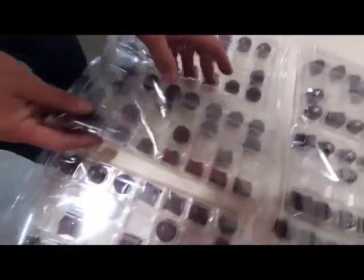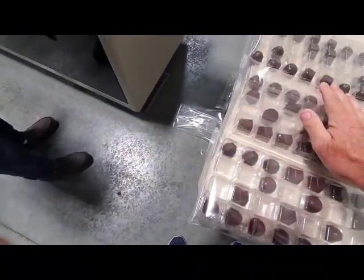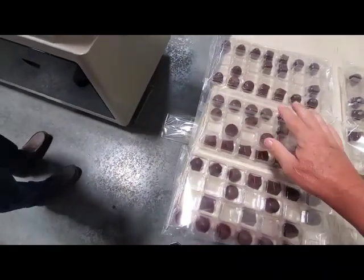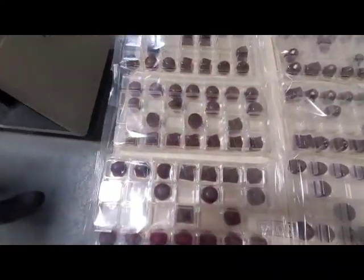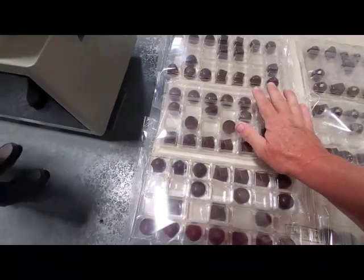These are going through a 40-minute heat cycle with very little transfer. Now there is some air pillowed in there right now. We need to put the air perforation device on here, or we can run a micro-perforated film that already has the holes in it — that'll help push that air out of the back.